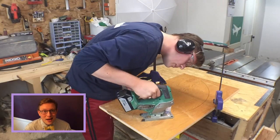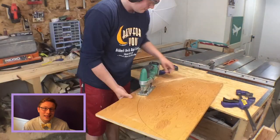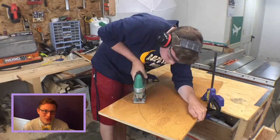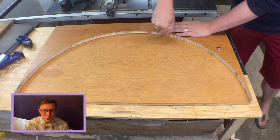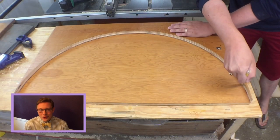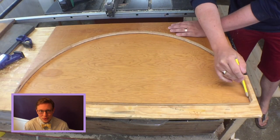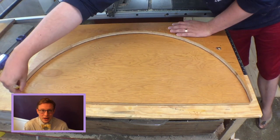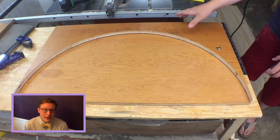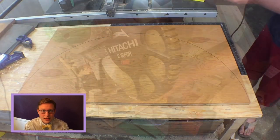Here we get to use the great big compass again and put that curve in. It was so much easier to cut out the curve on a quarter piece of wood than it was with my 2x materials put together. I would highly recommend this laminating technique if you were starting with the arch — had I to do it again I would have done something similar. And it's so easy to trace the pattern onto the other backboard and then onto the wood.